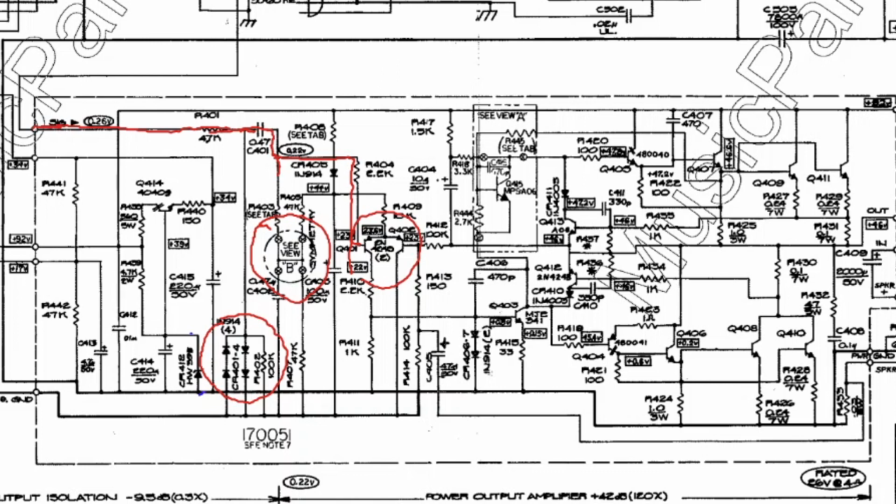And so that then, once you come out of this differential pair, you come to this driver, right? This driver right here. And then that driver, actually, how does that work now? So that driver then drives this transistor, and then that drives these three. This is the lower end of the wave, and then you see it drops. I'm not exactly sure how this works here, but I think this is running the other side of the push-pull, and that comes through. Oh yeah, that comes through here.